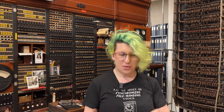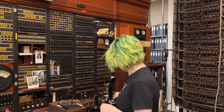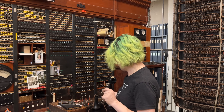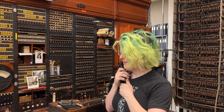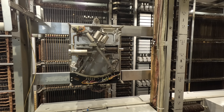That sound actually comes from the ringing machine — it's just the sound of bell ringing through the receiver of the telephone. It's continuous machine ringing without interruptions. If my dial is too slow it'll make a different sound. I'm going to force the dial to be too slow. Okay — that's what you hear if the dial is too slow. That test works awesome — I can be done with that, ready to move on to the next thing.